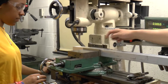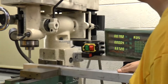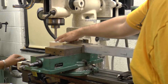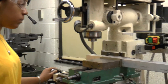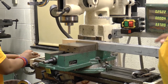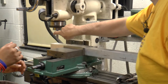Crank it until you can see that the face of this is even with this — that should say zero. Now move the part a quarter of an inch that way and the edge should line up at the center of your tool. Now this corner should be in the exact center of your tool.